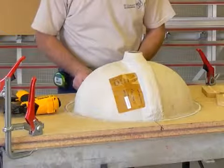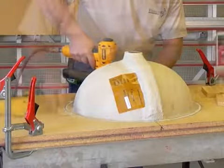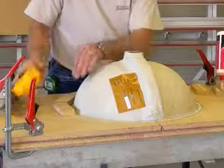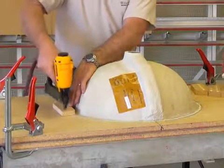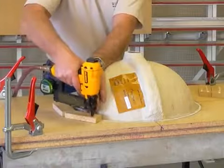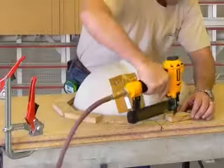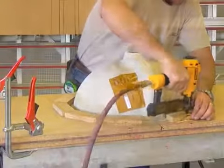Place 3/4 inch thick wood strips around the perimeter of the sink flange. Minimum 2 inch wide strips are required. Strips should cover only the area of the sink flange that was previously trimmed. A 1/2 inch overhang is best. Secure your supports with wood glue and properly sized screws or nails.